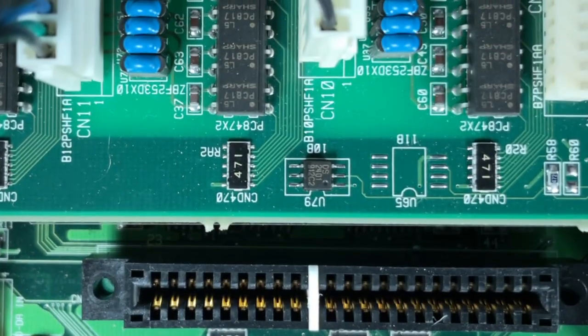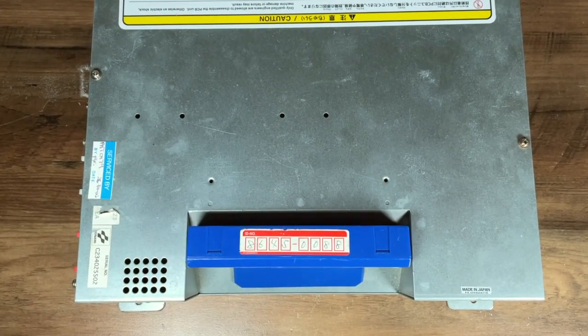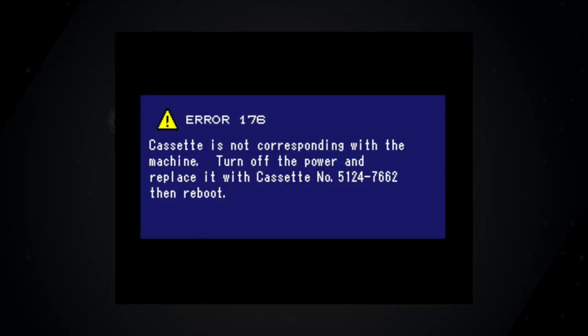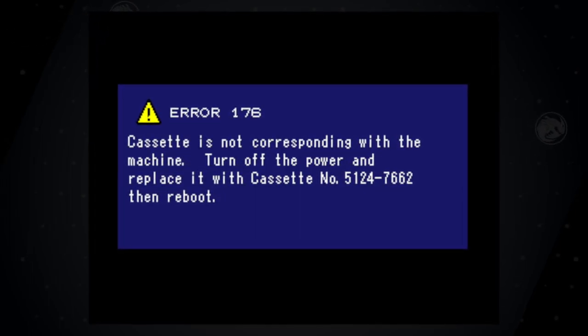The digital board also introduced a less welcome feature. Each digital IO board was built with a DS2401 digital ID chip, making each 573 unique with a 64-bit serial number. Konami used this to marry each security card to the game board — at least in the case of Bemani games — meaning that even legitimate CDs and cartridges previously used would simply refuse to work on a different unit. This doesn't appear to be anti-piracy so much as forcing operators to buy new mixes from Konami's distributors. Which perhaps explains why bootleg discs became so popular.